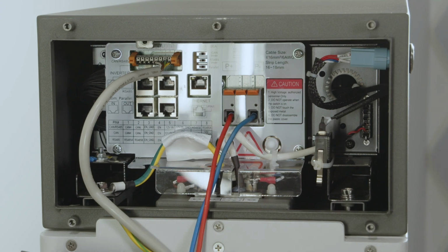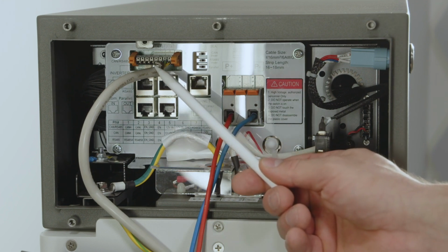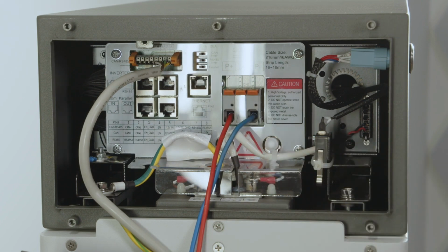The first one would be, such as we did, to go for the top one. Like here, it is this connection point where we are able to connect the 4 necessary poles, which is data plus, minus, ground, and a 12 volt steady DC connection. All 4 pins are able to connect on the Pilot.